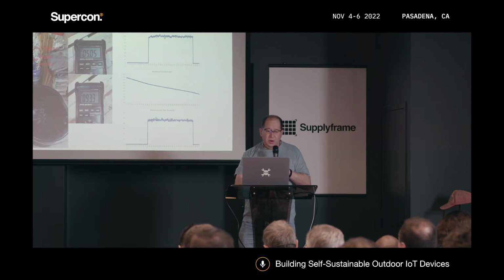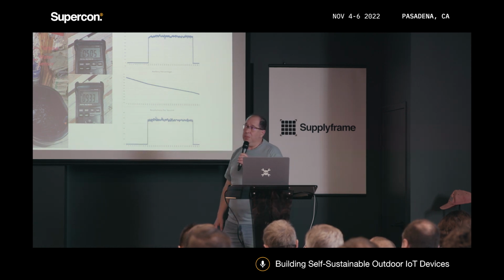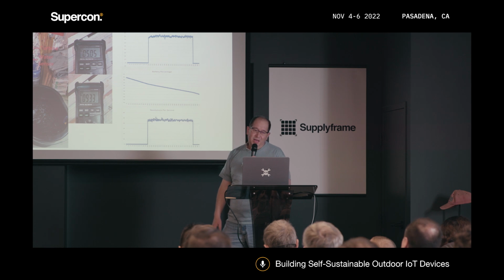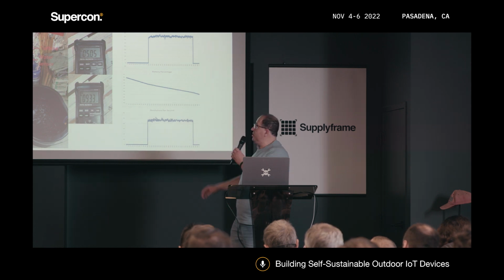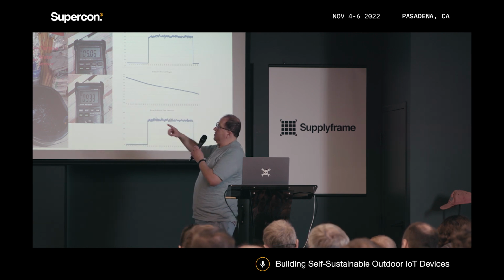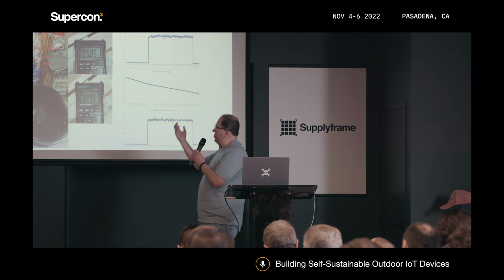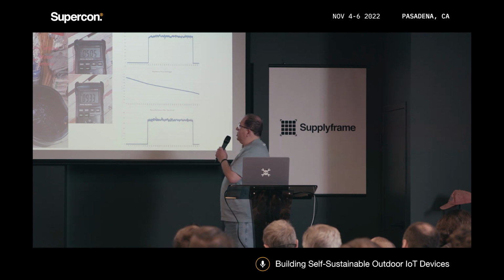All right, so we started first with our water-based testing. We call it liquid electricity just to make a fun name out of it. We started it with just one water turbine that you can see up there in the yellow. And then there is a water sensor that is nothing more than just a propeller that is counting how many revolutions the water is going through there. The turbine that we are using gives around 5 volts of power and about 93 milliamps of current.